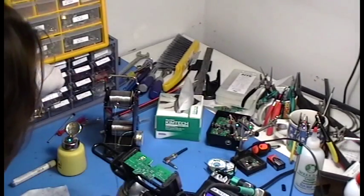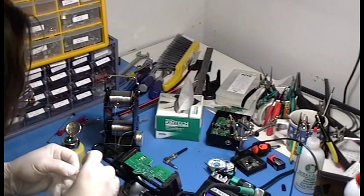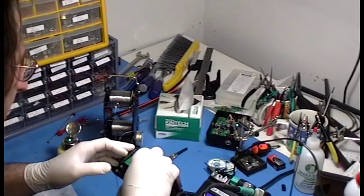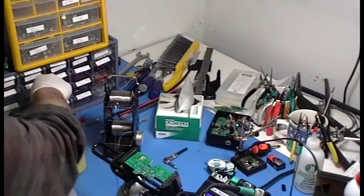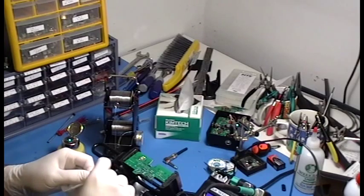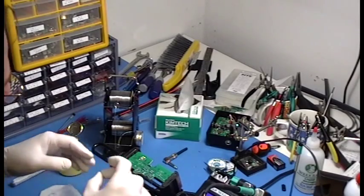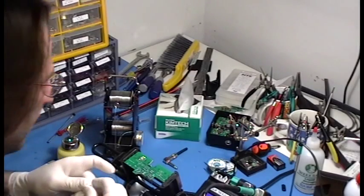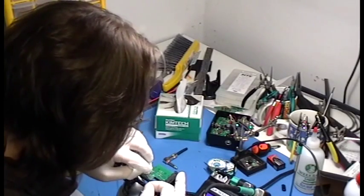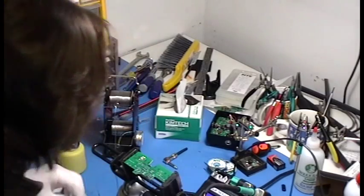Okay. There we go, nice and clean. This actually really does make a difference. I saw a large difference in the quality of my joint several years back when I just bit the bullet and decided to just clean everything going in. It really does make a difference. I wouldn't do it any other way anymore. You know, I don't bother too much when I'm wiring up to the box. It's really not that big of a deal in the box, but with little joints like this, you know, even small amounts of grease and dirt and junk, I see a little bit of, it's not really residue, it's just a little bit of junk that got on there from the IPA, because again, the IPA is not really perfectly pure, just like that off.